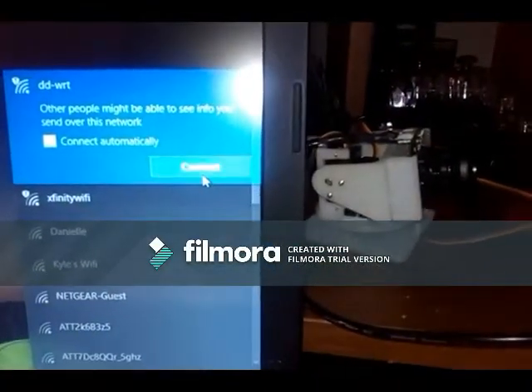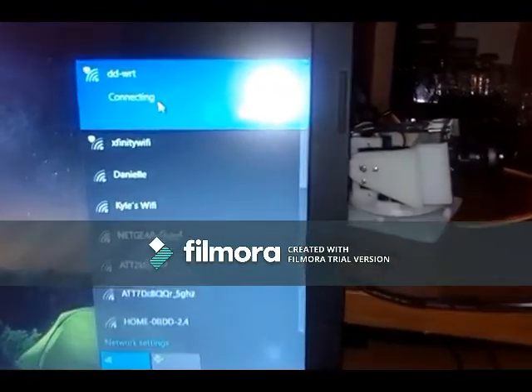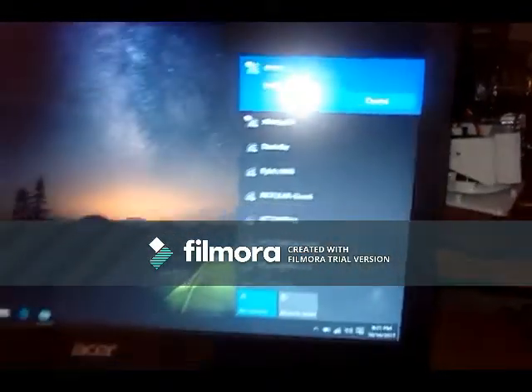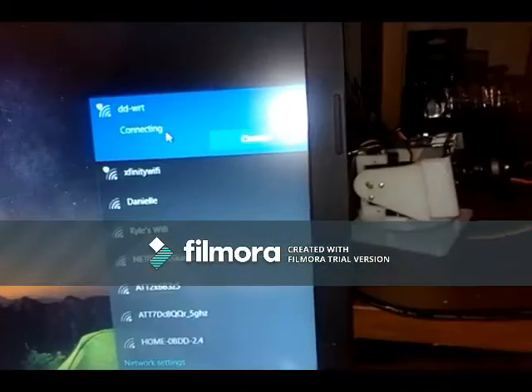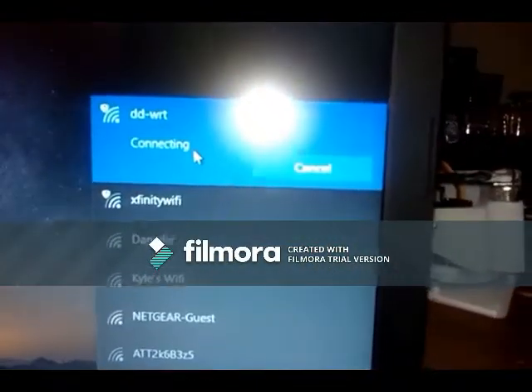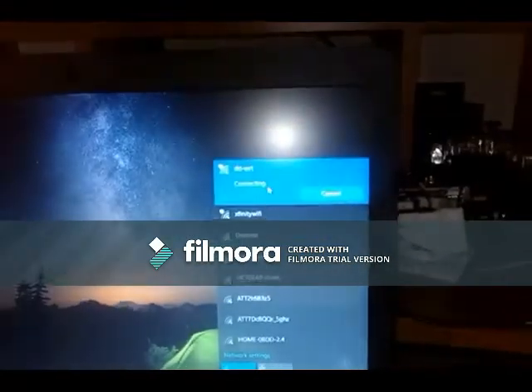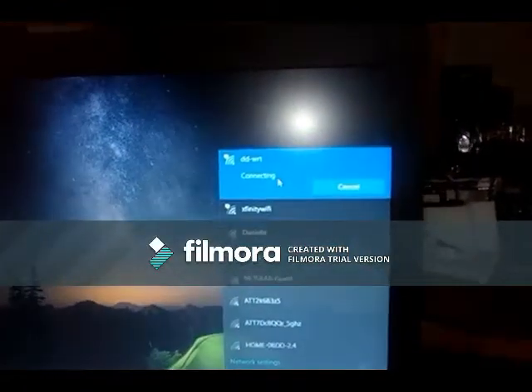I'm going to connect to the router on my laptop. I don't have any wireless security settings — I'm not using WEP or WPA. It's open, it's an open hotspot, just for the simplicity of the video. I'm not going to type in any credentials. The Arduino will not do anything for 50 seconds — that's how the sketch is written.